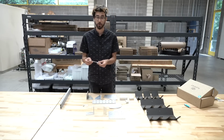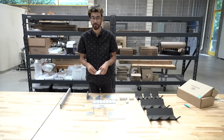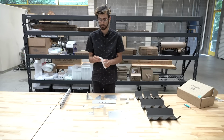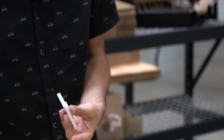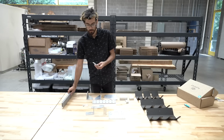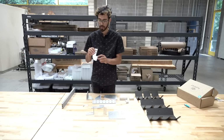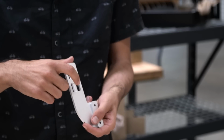In the version 1.4 kits, we include a second one of these components, and we've renamed it to the peripheral mount plate because we use the second one now to mount the solenoid valve onto the gantry column where the electronics box is mounted. Again, you'll mount the plate using the 3 holes here, and then the solenoid valve is zip tied to this section right here.